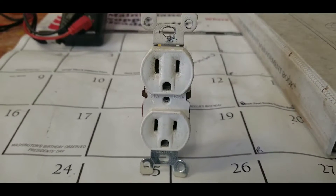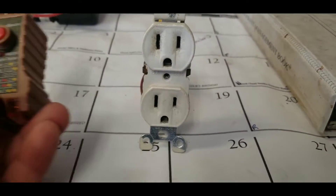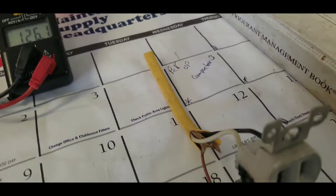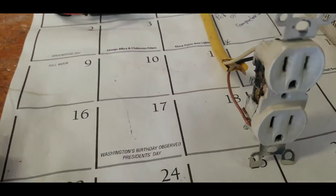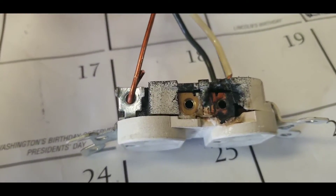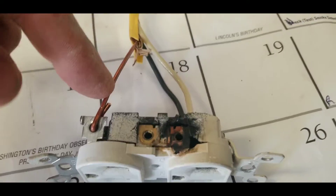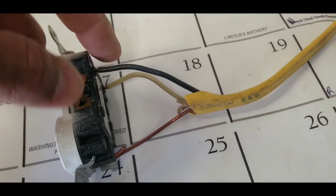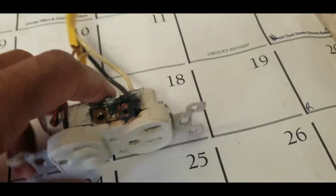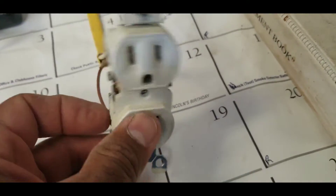Major appliances should have a dedicated circuit coming straight from the box. You'll see in part two why it's so important to have this. We take these electrical leads and use the meter — we were getting 110 volts between the neutral and the ground. That's really, really bad. From the ground we were getting 120, and nothing from the black and the white.